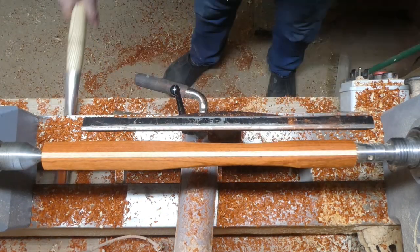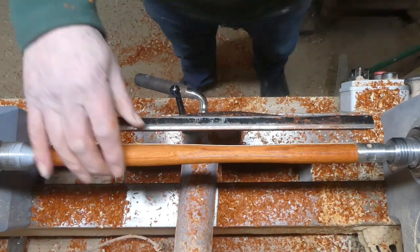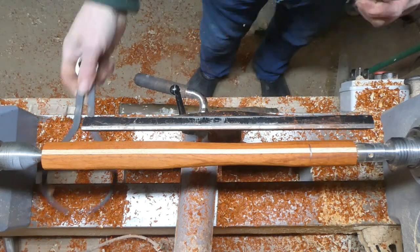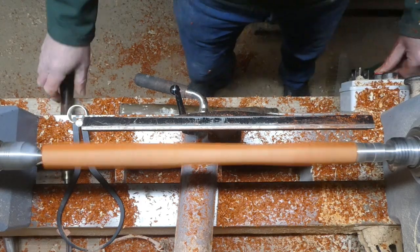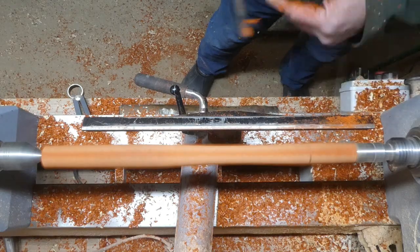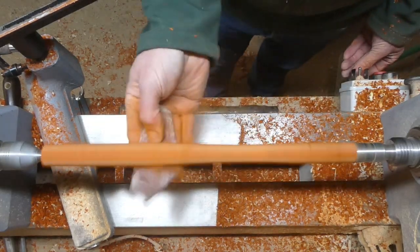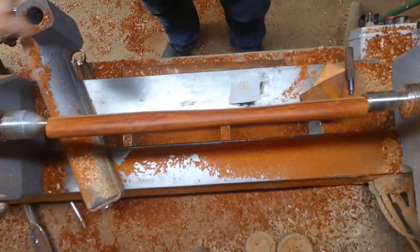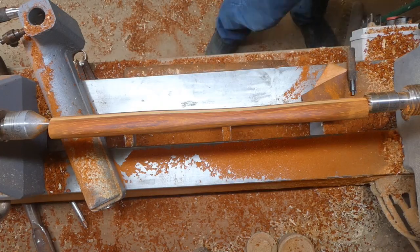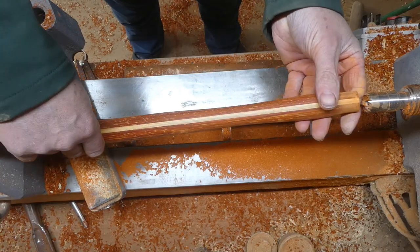I've put it in the centre again because I finished up with some sharp points on the wide point of the shaft. Here I'm working on the head end — the hammer head end. I've marked the widest point and I'm taking the width down to where it fits into the head of the hammer. There's a limit to what I can do on the lathe. Now I'm sanding it down from about 120 grit. I've got a decent finish on it — padauk does turn quite nice. I'm sanding it with the grain to keep it nice and smooth. It actually looks quite nice just sanded, but I will be putting some extra finish on it.